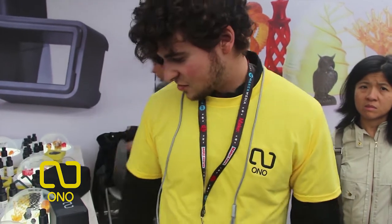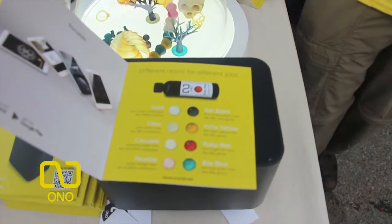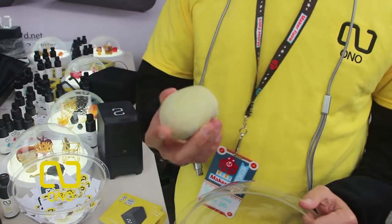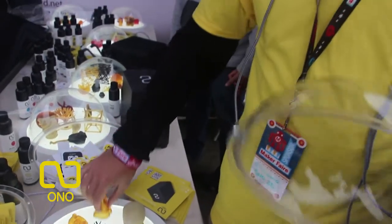Tell me what resins you carry. We have eight different kinds — four different colors: black, yellow, red, and blue, as well as a more clear, translucent resin. We also have a very hard, stiff resin and a flexible one. The best printing resolution is a height of 100 microns, but you can push it to 50 microns — you start getting more failures at that point, but you can reach it. The XY resolution depends entirely on your phone, but with a 4K display you can reach up to 42 microns in resolution.